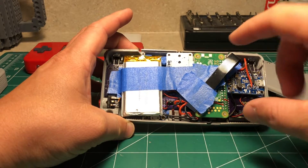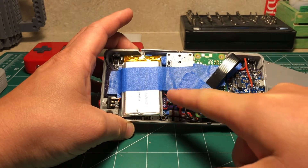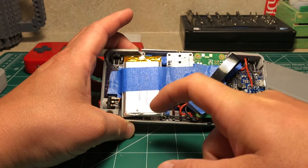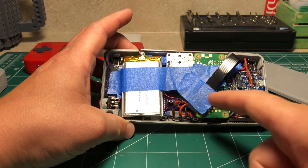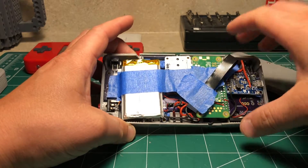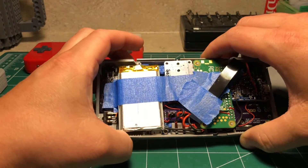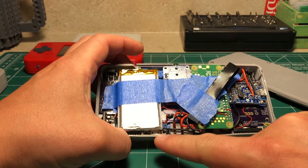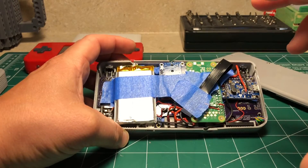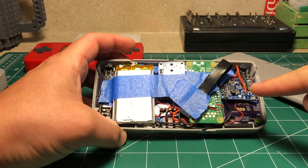You can see how the PCB fits with all the components. Here's the Pi. You'll have the decoder here, the mono amp — which isn't on this design but it goes right here. The battery fits here, the 1000C power boost fits over on this side, the screen is on the other side of the PCB, and there's a micro USB adapter that fits right down here.